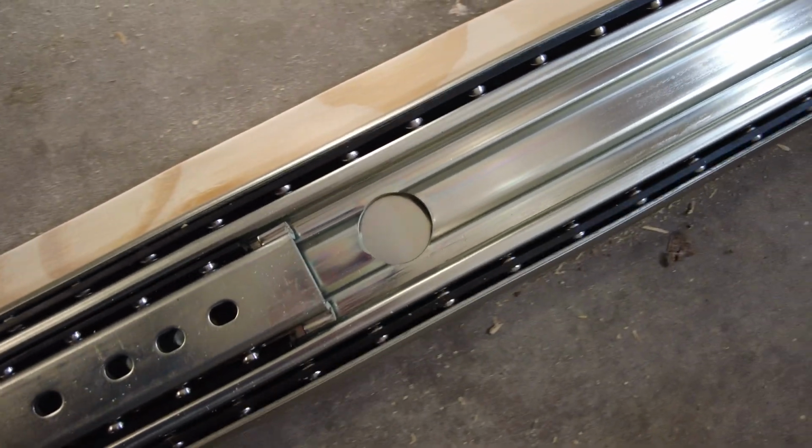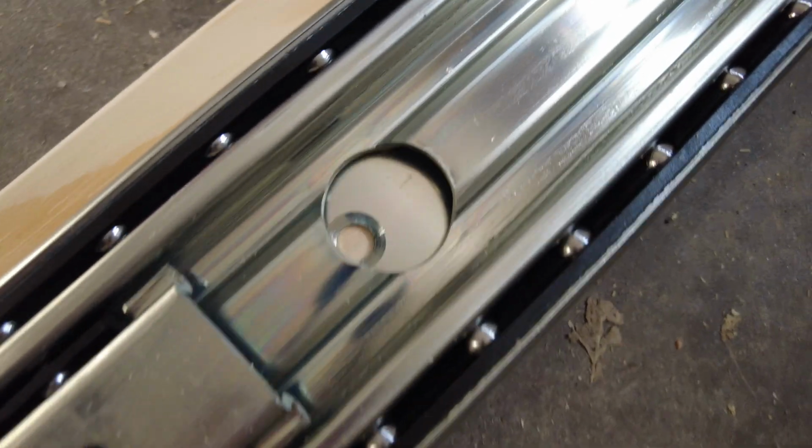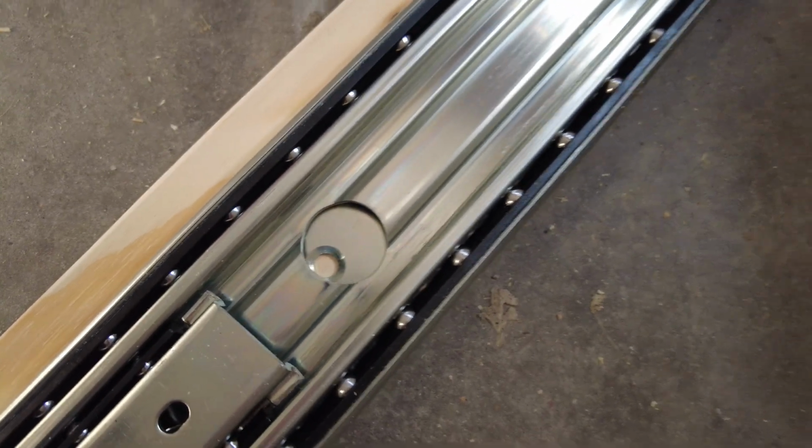You can then begin screwing the sliders into the side plates. You'll need to extend the slides in and out to find a number of hidden screw holes under the sliders, accessible via the bigger hole on the slider. I think there are about 3 of these.